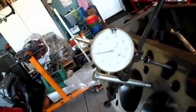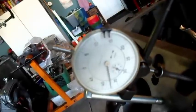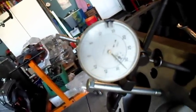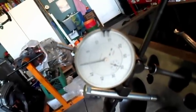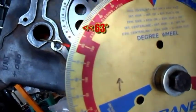Now we are going to back up 50 thousandths, going past it, so that everything we take a reading on is moving forward. Now we come up to zero — past it. Let's go back a little bit. We come up to right at zero, and we take a reading off our wheel. It is 63 degrees.